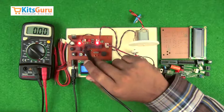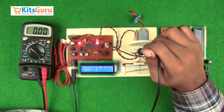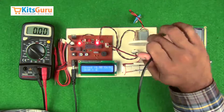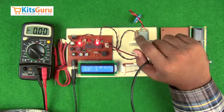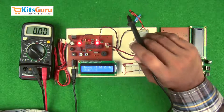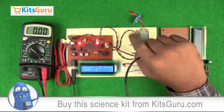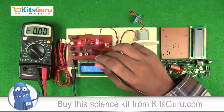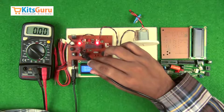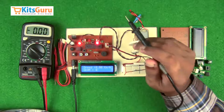There is an IR transmitter which continuously transmits IR rays to the receiver. This wheel has a gap — a slot — in between. Whenever this slot comes between the transmitter and receiver, the signal is received by the receiver, and at that time the signal indicator LED blinks. This receiver gives an input to the LM358 comparator IC, which converts the analog signals into digital signals.